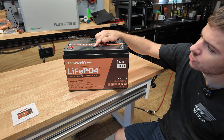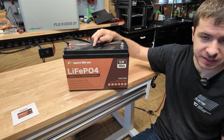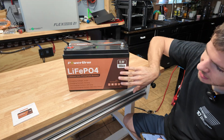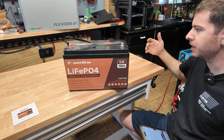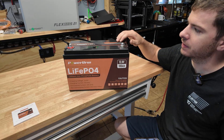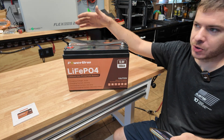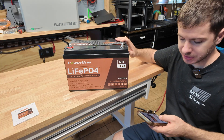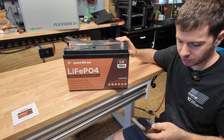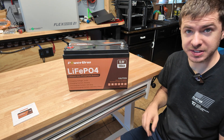What's interesting about this battery — I haven't seen this on any other ones — is it has like a vent built into the lid. It also apparently has Bluetooth 5.0, though it doesn't say anywhere on the battery itself that it's Bluetooth. It says on the website, so we're definitely going to test that. They say it has a five-year warranty. This is a standard size battery, not a mini. It can do 100 amps continuous, rated at 50 amps continuous charging, with maximum continuous discharge of 100 amps and 200 amps for five seconds.